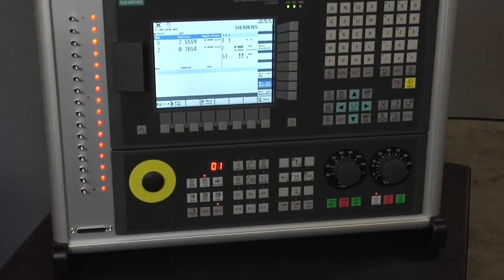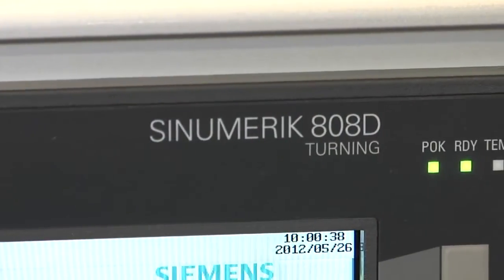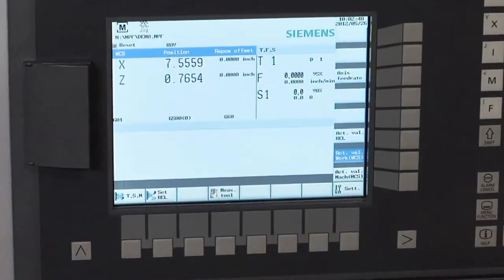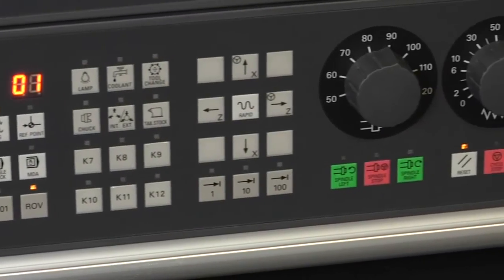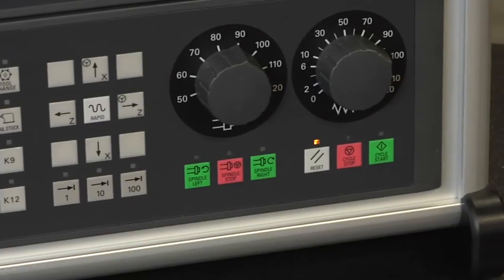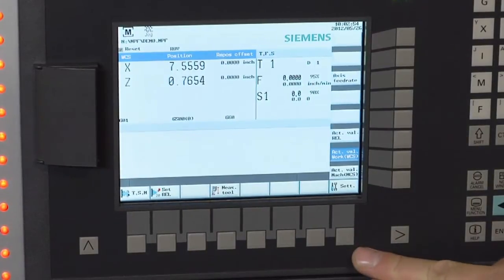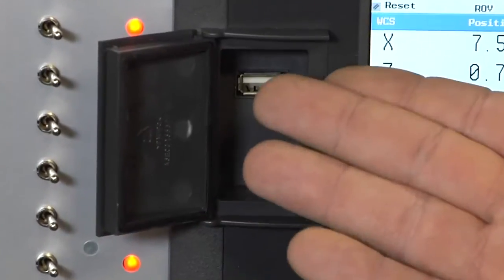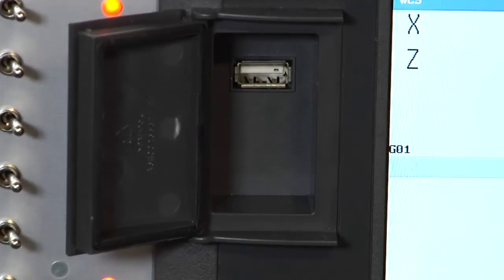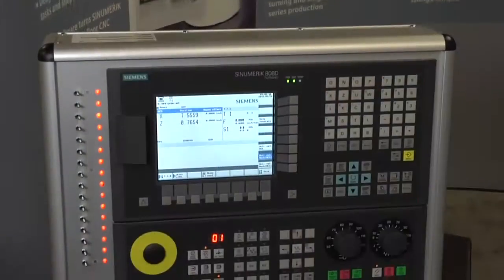What we have right here is a brand new product called the Siemens 808D Control. It was first debuted at IMTS and it is a system used to leverage entry-level mill machines and lathes as well as secondary op milling machines and lathes. It's a very simple user interface — you maneuver through the software using the horizontal or vertical soft keys, and for data transmission and loading programs in and out it also has a USB port. It runs as a full CNC system and has simulation graphics included within the package.